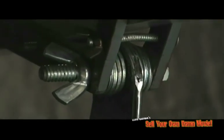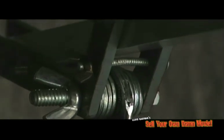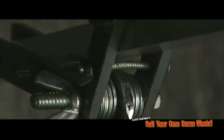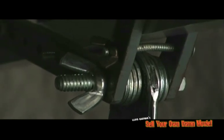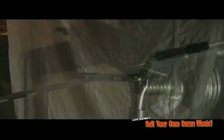I can loosen that silver part and raise it in order to lift the boom up above head level so that it's out of the way of the camera. The pivot part is a couple of brackets made by a machinist friend of mine. I put a bolt through with several washers and a wing nut. You tighten down on the washers, and this gives the arm the ability to be moved back and forth — but it will stay wherever you put it because the microphone is so light.